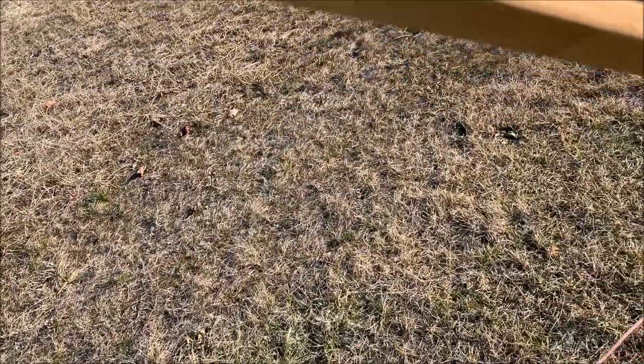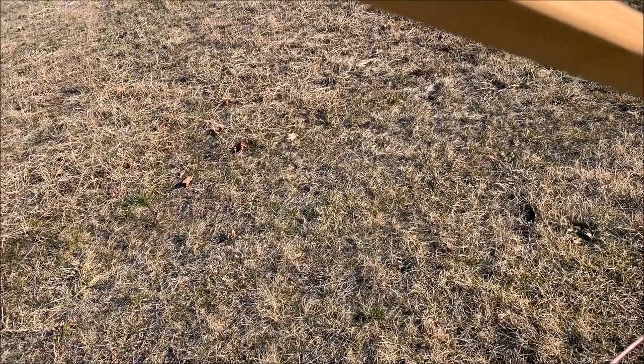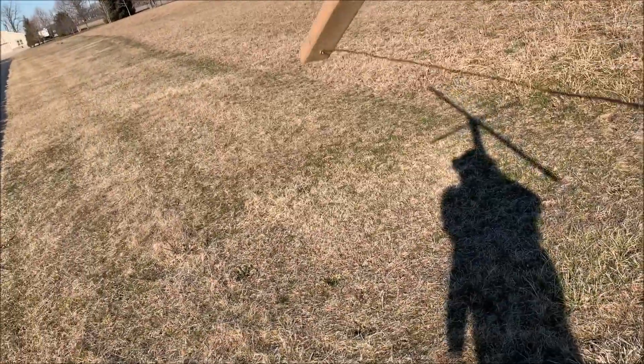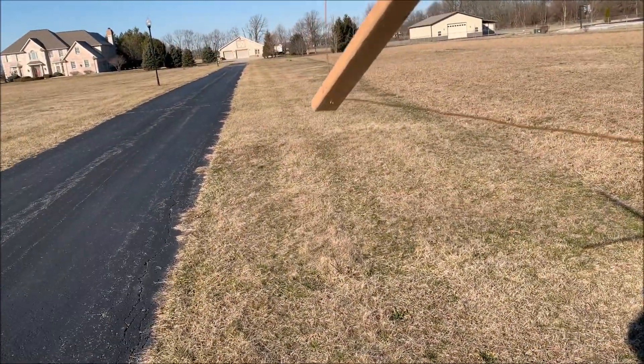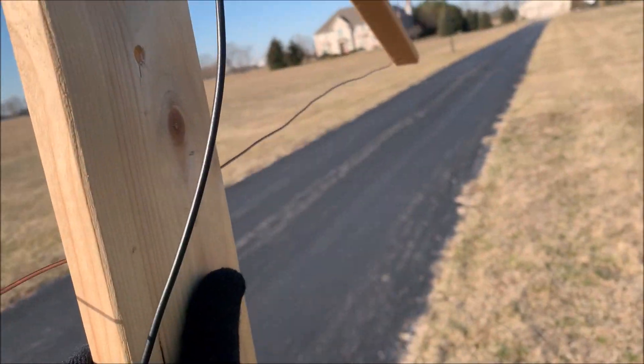I was able to use a flag antenna to understand exactly where that signal was coming from at KB9AX's house, at 18 megahertz. That's the backside of the flag right now. I could reduce the RF gain, but we'll leave it up there for right now. You can hear the noise level — rotate the antenna, and you can see just how strong it got.